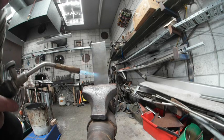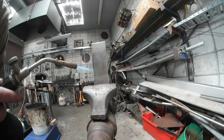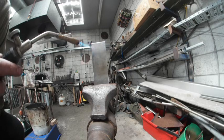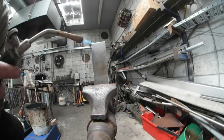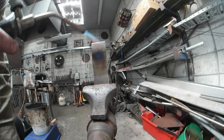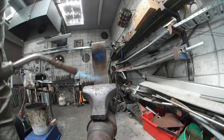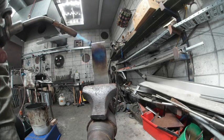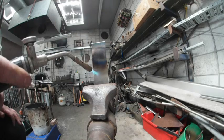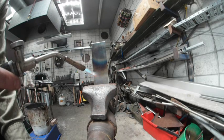I think I'm starting to see a very light, faint yellow. The reason I'm going up and down the whole piece is I want to keep the whole piece of steel relatively evenly coloured, so I'm not overly heating up a single spot. I think I overheated it in the middle by moving side to side — I should probably use more of a motion like this instead.